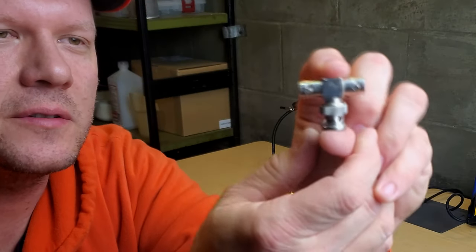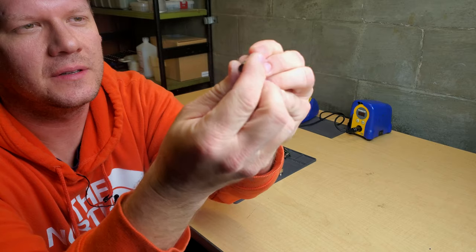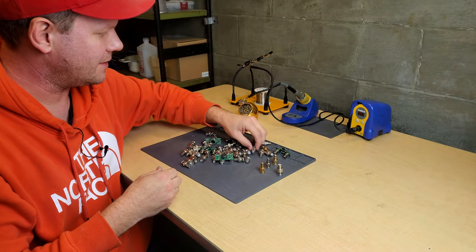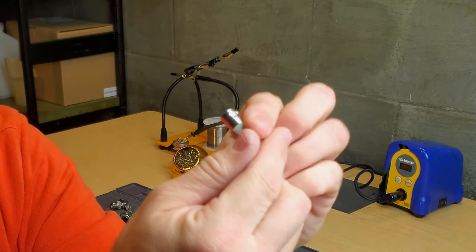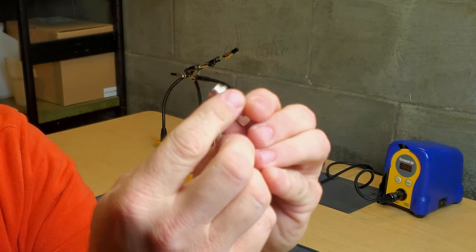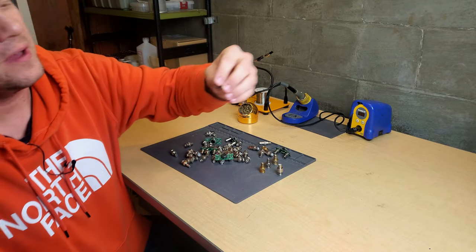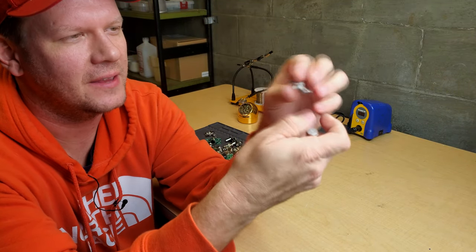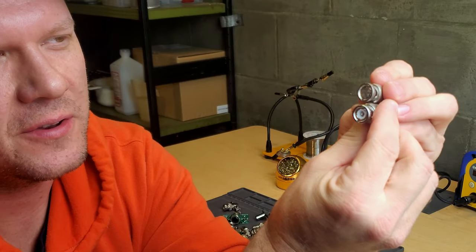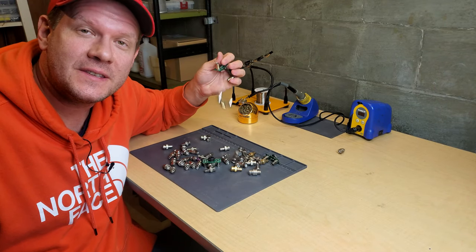Here's an interesting little splitter — RCA on this side, BNC on this side. And here's another one that is kind of funny: this one gives you coax or RF on this side and BNC on this side, just a different connection type. Sometimes you'll also need to use these 75-ohm adapters, and these range in quality as well. If they're weighted heavy and look properly built and shielded on the inside, that's a good sign. Enough of these — let's get to the monitor.